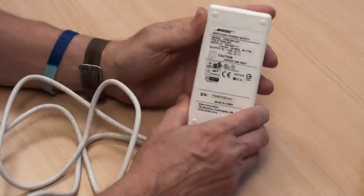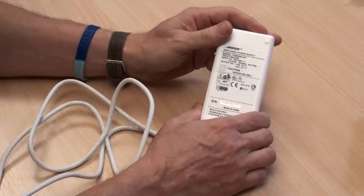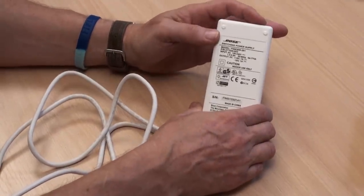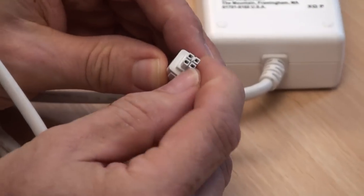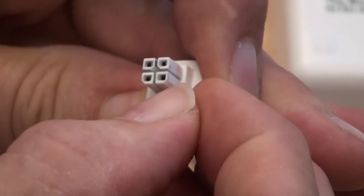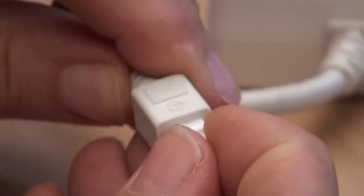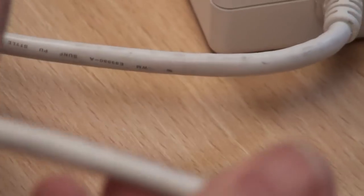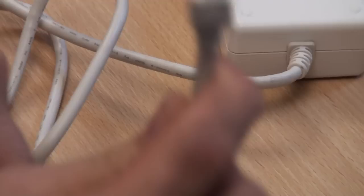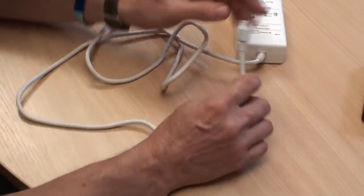If the 201 does get warm, that's a very good sign — I don't think I've ever seen one that got warm that didn't work, and I've fixed hundreds. Also check the DC plug that goes in the back of the dock: make sure all four pins are present, not cracked or broken, not blackened or deformed. Then inspect your cable all the way down — make sure it's not loose, hasn't been chewed by a rabbit, no nicks, hasn't been trapped under a table leg. Cable in good condition and connector good: if it stays cold it's faulty.